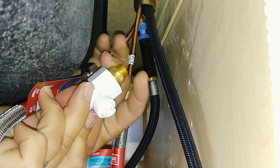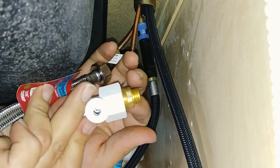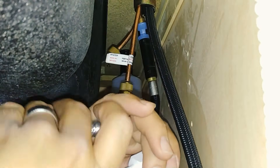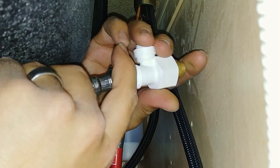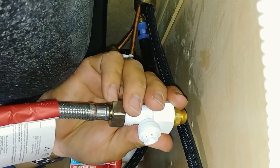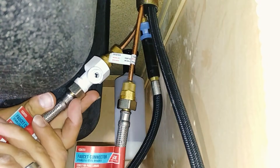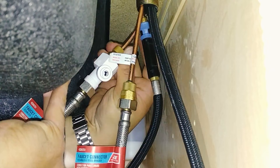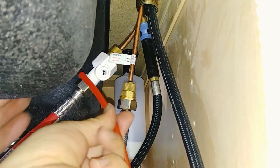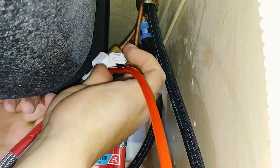This actually had a fitting that I could undo to take this down, so I get this brass connector nicely snugged in here, letting the gasket do the work of the sealing. Then we will connect our whole adapter here — hand tight is almost enough, but a little bit extra is good. And then we can take our red hose here for our supply water line and just push that into the connector, and we should be good to go.